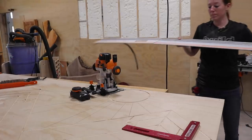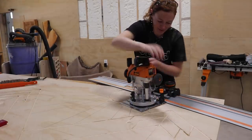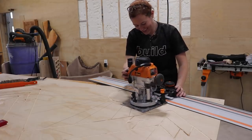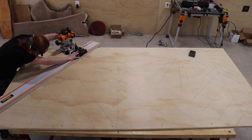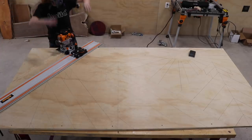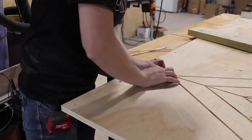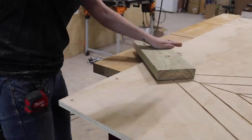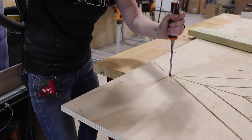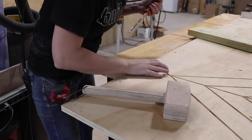Back to the track adapter to finish making all of the straight line cuts. I also had to fix a mistake I made on my very first cut — I overshot the stop point and by the time I realized it, it was far too late to do anything about it. Filling it in was pretty simple though; I cut a strip from a scrap piece of ply that fit right into the groove.